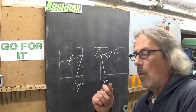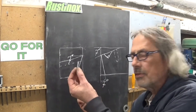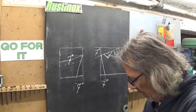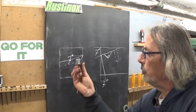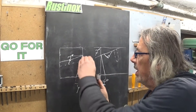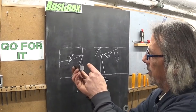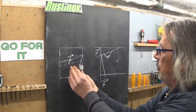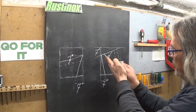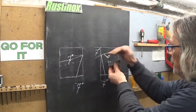Imagine I have to make a special tool holder that can hold 6mm round high speed steel. The tool holder is for the lathe. I need a top rake of 7 degrees, a clearance angle on this side of 7 degrees, and if we look at the tool holder from the front, I need clearance of 7 degrees that way, and the face is leaning down also 7 degrees.